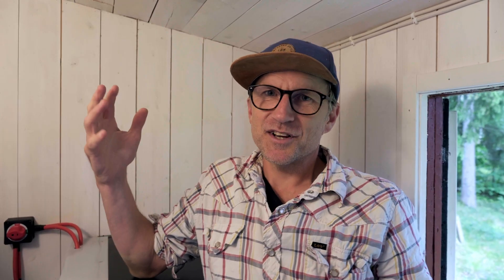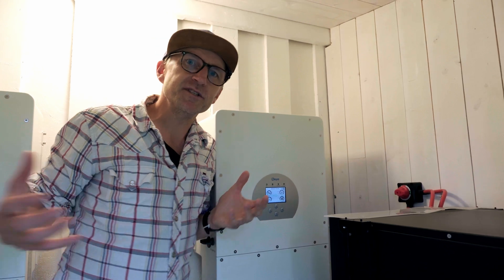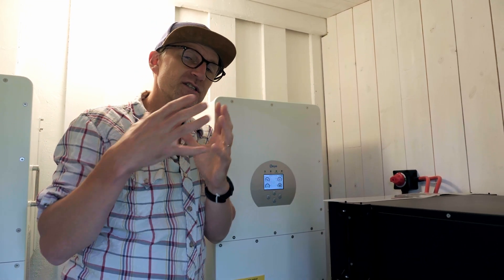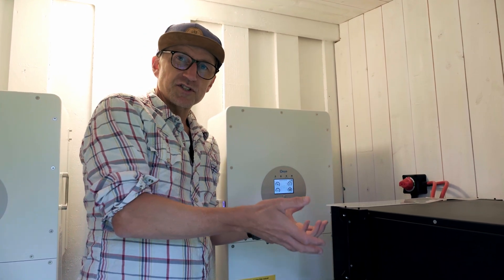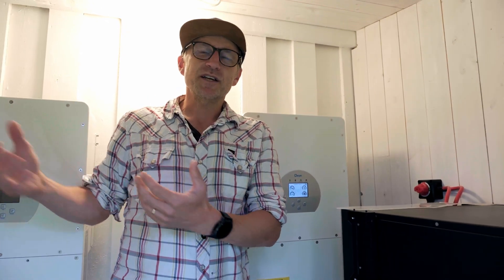You still have to have everything professionally done by an electrician here in Sweden, but when they came around we did do a grid test, and I think we had to pay for two kilowatt-hours. The greatest thing with this system is that we're actually off-grid for a larger part of the year, and when it comes to the winter and the darker months when there just isn't a lot of light, that's when the batteries really come into play and work so well with the grid. During the wintertime there's a large number of people who need a lot of electricity up here in the Northern Hemisphere and Europe, and that has meant that with the changes in the electricity market, the prices have gone through the roof. A battery system which is grid-tied also gives you the ability to charge the batteries at night-time when the price is generally cheaper, and then during the day it's programmed to utilise the power that's sitting in the batteries at the house, and that way you're saving a fair bit of money.